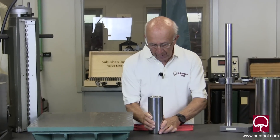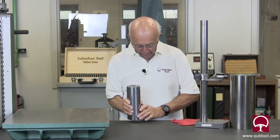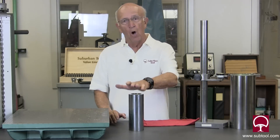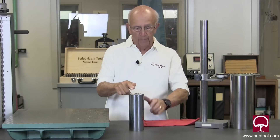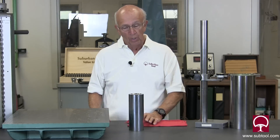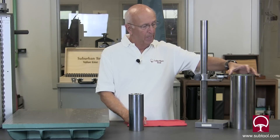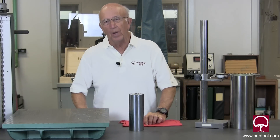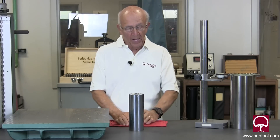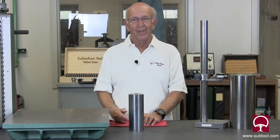And that's the way I would do it. So that would set it up. I wiped the bottom, by the way — keep everything clean, wipe with your hand. And slide. So that's how we would correct a cylinder square if it's off a tenth or two. Again: check four sides, determine which side is high, mark it, take it over to the lapping plate, give it a couple of swipes, come back and check it again. When you're checking up here 12 inches away, based on about a four-inch diameter, you're probably only going to take off less than 20 or 30 millionths to make that change — because remember, if you're off a tenth, you're really only off 50 millionths on each side. So that's the trick to checking a cylinder square and getting it back in square. Thanks for watching.